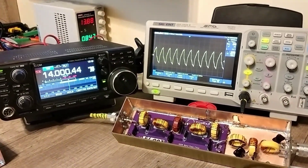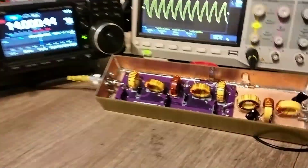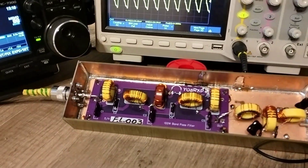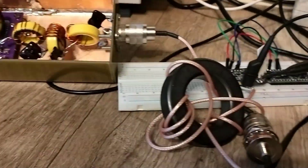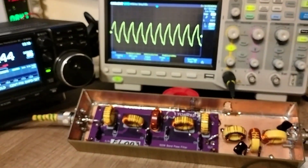For high power, another 1 kW low pass filter with an extra 30 dB will be used. Of course, RF coupling, common mode chokes, and power line filtering are mandatory, but all of this will be shown in a future episode.